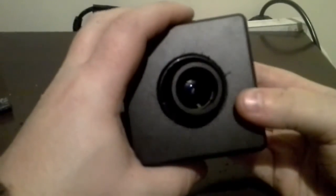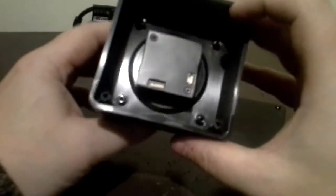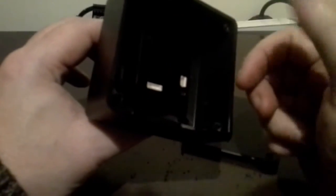Then what you can do is offer this end cap up initially — it won't go through, which is okay, that's exactly what I'd anticipate. Not as many turns needed this time. As you can see it's not a lot of work. Then press that in like so, and you've got a nice camera mounted square — no messing. Then all you've got to do for the wiring is drill a hole wherever you like through here. It gives you space for the remote control on this particular camera module — you can squeeze all that in and keep it all contained. Nice square box with a square lens.